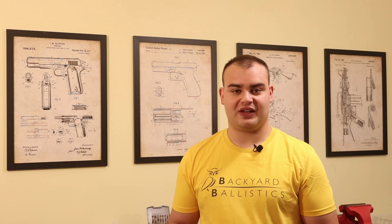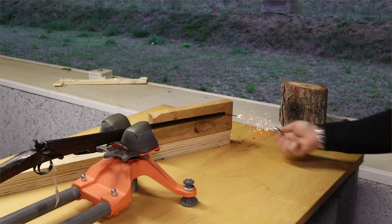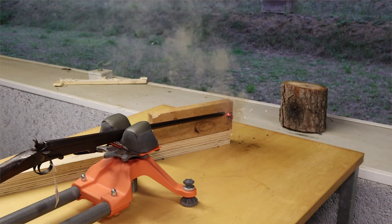From part 1, you may remember that the function of the hammer is not only that of hitting the primer, but also deflecting the ballast out of the way to prevent accidental impacts between the slow ballast and the fast-moving bullet. For this reason, I tried to compensate by placing an improvised deflector near the muzzle, which of course wasn't very professional, but it was good enough for a test.